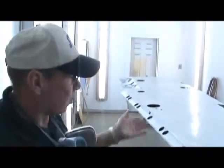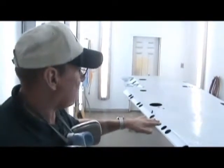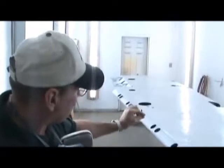We just refilled the spray gun and turned the wing back over to where we started. We're going to wait a few more minutes. Normally if the temperature is warm it will be ready for the second coat right away, but it's fairly cool in here — probably 65 degrees. You can see a little bit of shine left in the primer. As long as there's shine and it's not dulled out yet, it's not ready for the second coat.